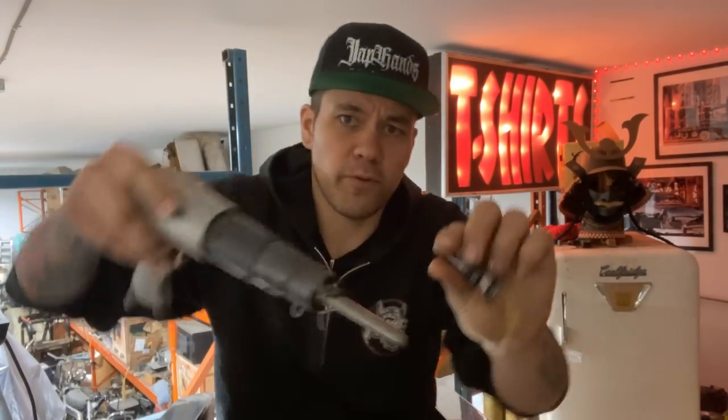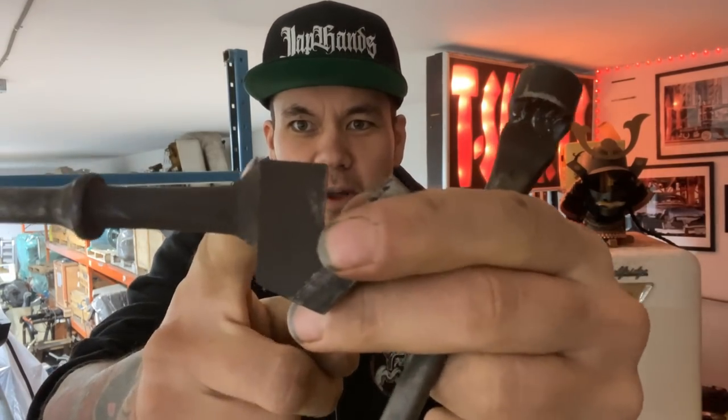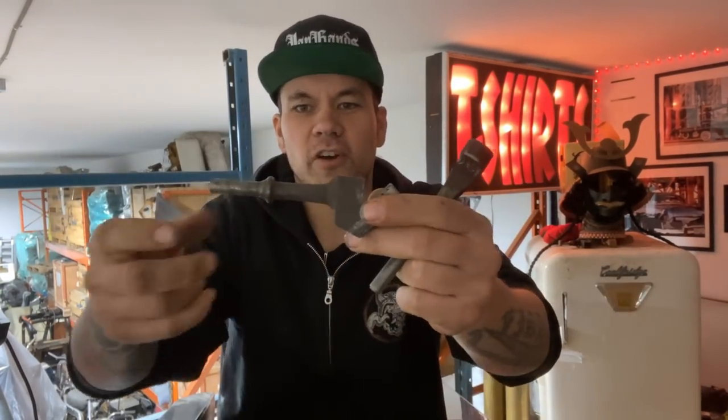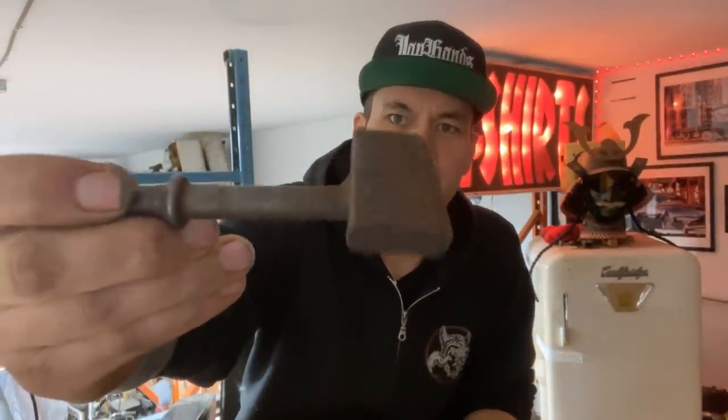It's just for beading or whatever. I just kind of smoothed it over in the end. This one's a planishing head that I use to fold over pieces of metal. I've got a couple other ones I've put things on before. And these are mostly just, you can see where I've just welded a chunk onto the end of an existing air hammer bit, I should say. Here's another one that's almost like a crease I was trying to get into a panel.